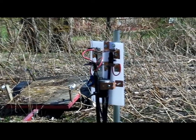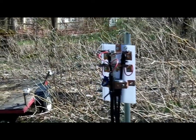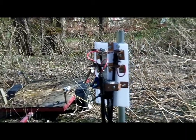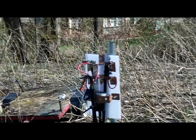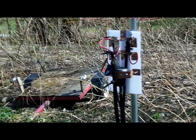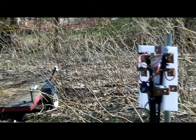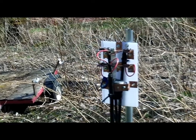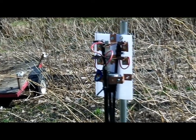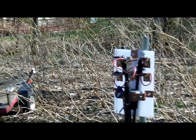Cut your elements to 7.175 or 7.150 — this one is cut for 7.175 because I'm General class. Use 38.6 feet of 75 ohm coax to the feed points, get yourself a DPDT switch or relay, whatever you want to use, feed it with 50 ohm, and you've got a nice considerable gain on a 40 meter array with great front-to-back. Case closed, thanks for watching, K1 GMM.